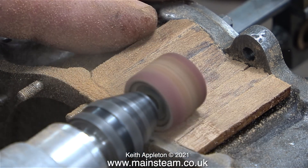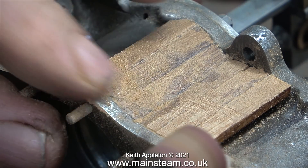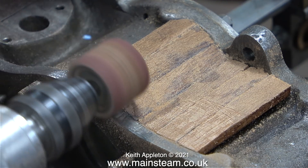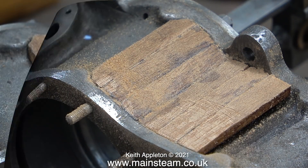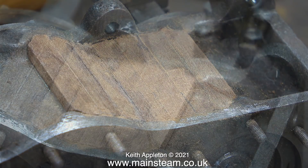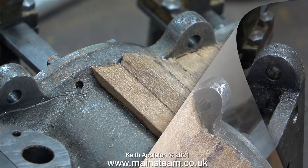Here I'm dicing with death — I'm using a drum sander to level off the strips. The unmachined casting is quite uneven and the packing wasn't perfectly level. Using a drum sander is not a good idea unless you've had plenty of experience in using one. Just one slip and the job is ruined. The way it looks at the moment with some scratches on the surface is not important — these will be removed when I do the main sanding operation by hand.